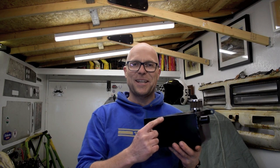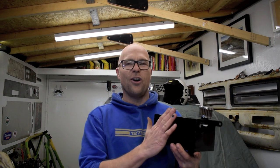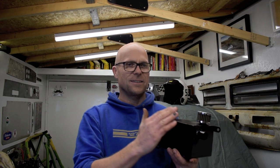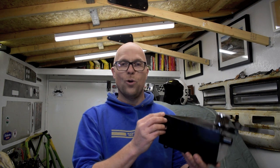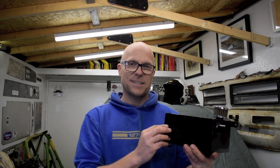I think the main reason why my catch can leaked is I welded it from the outside to the outside and then I used a flap disc to make it flat. If I'd actually just left the bead weld on there, I think it would have been much stronger and more airtight — fuel tight, whatever you want to call it. Oh well, lesson learned.